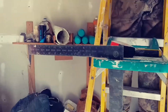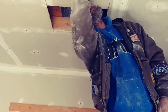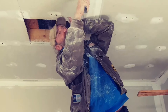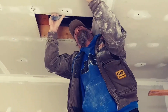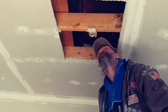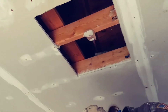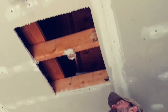The first thing I'm going to do is take a square and measure off of the ceiling joists. As you can see they're about 14 and a half inches apart, so I'm going to have to cut one out and build a box with a 2 by 6 — that's how you're going to do it. We're going to cut that out right there and build a box for this thing to sit in. Then we're going to have a piece of trim that overlaps it on the bottom and this vent is going to sit down in it.